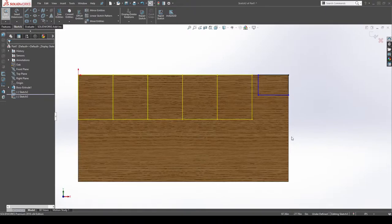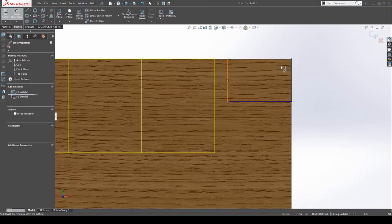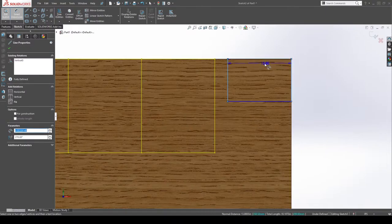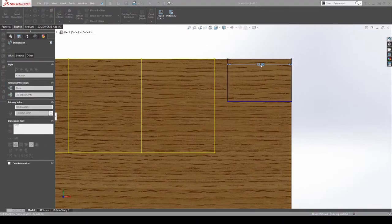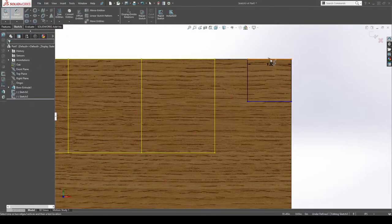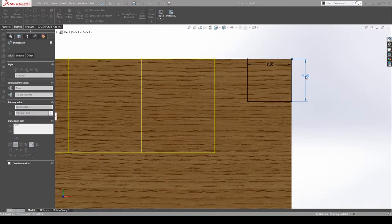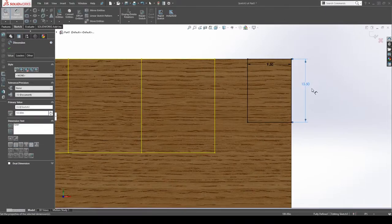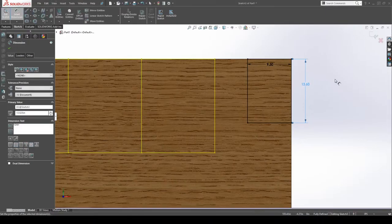And making replacement shelves for my hall closets, because they're OSB right now, and I'm not a fan of it. I don't like it. It's not a clean look by any means. So that's what I need the shelf to be. But in order to account for saw blade kerf, we'll throw another eighth of an inch on there.